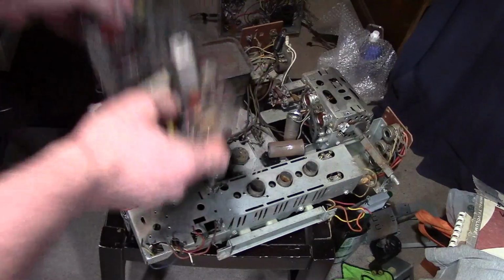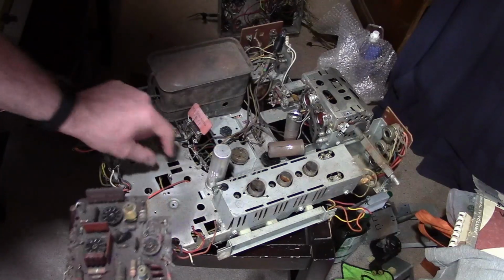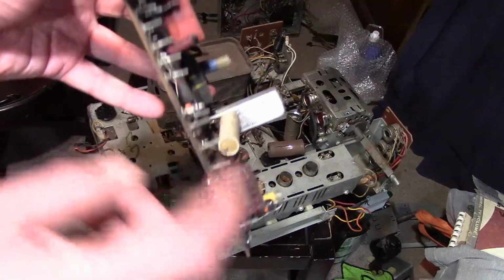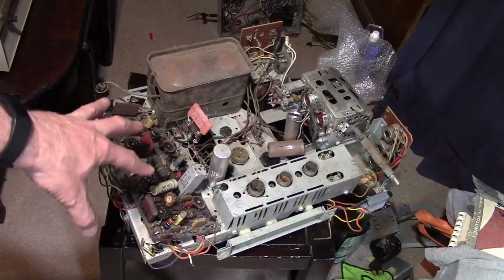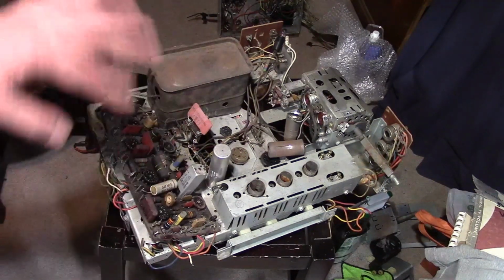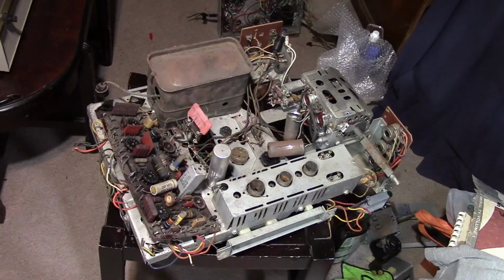They are secured down with the stakes bent up on the chassis, and they go through the circuit board and they're bent over, and they use wire wrap on these stakes. So when this is mounted down, they have steel covering it. You can't get at the board. They called these perma-circuit modules. I think their intent back in the day was they wouldn't need to be serviced. Or the set, you can call planned obsolescence. By the time anything on this went bad, get them to buy a new TV. Whether that was part of the sales and marketing idea from the beginning, I don't know. I have no idea, but it's a possibility.